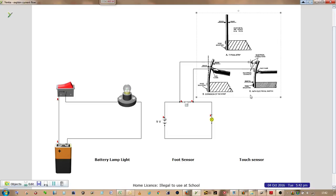You can also control the temperature of a vehicle, or of a certain device, so that when it reaches a certain threshold, the contact is made and it goes on. Also, you can make it a closed switch like this, so that when it gets cold, maybe you're controlling a device that you need, the switch will remain in the open state. Now when something gets cold, it closes and an alarm goes on, or a light switch goes on.